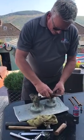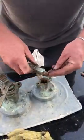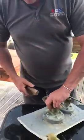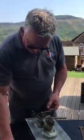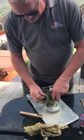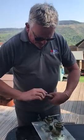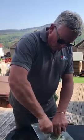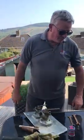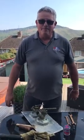Here's one I prepared earlier — you can see how much nicer that is now; it's all cleaned up and done. The last little thing my dad used to love telling me: if you look at the state of this, a good brass brush will clean this up a treat. Sometimes you can't get inside, but if you get a piece of dowelling with a flat on one side and a bit of grease on the outside, you can wind that down inside and start to remove the corrosion from inside. So that is roughly where we are — thanks for watching, please subscribe to my website.